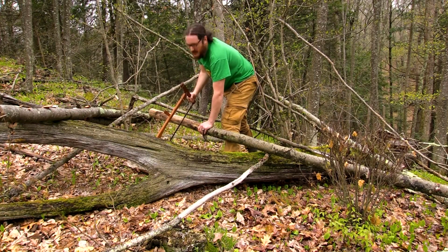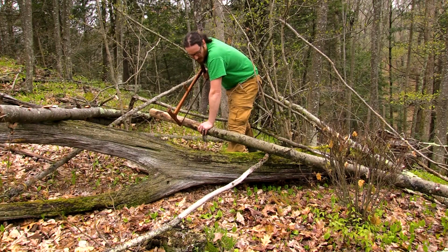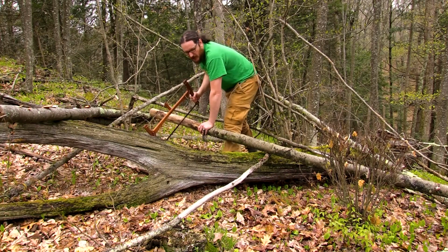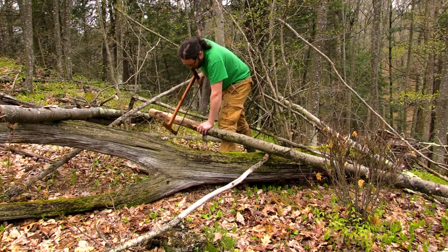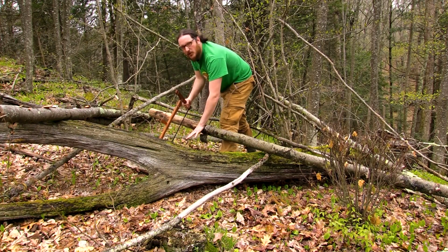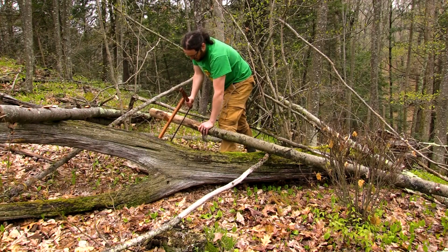When you're creating your beginning notch, you want to go with the blade on the opposite direction of the cut. So right now I'm doing a push cut, where all the energy, the blade is designed to cut on the push and clean the notch on the return. So that's what I do.